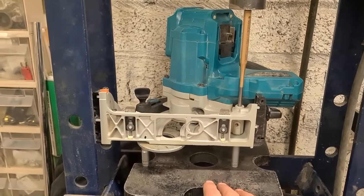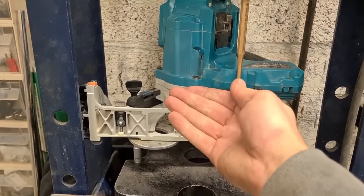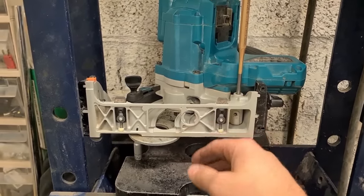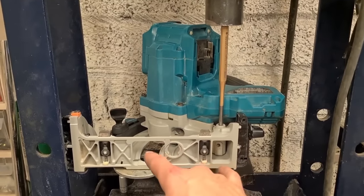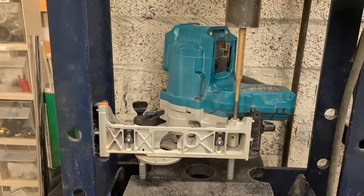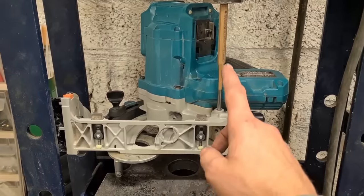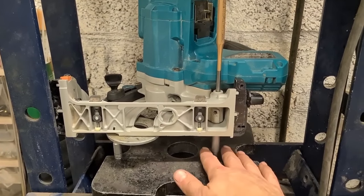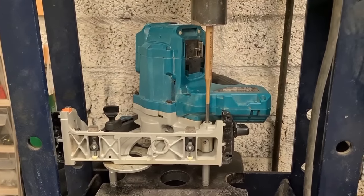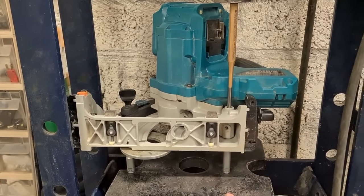If you don't have it sitting as flat as possible before she's put under load, and if you press down, everything's going to lift till it is flat. All your supports will fall, and then if she skates on you, she's going to go flying to the ground. Not what you want. Try to get her leveled and sitting up the way you want before you start pressing down. And once you start pressing, if you're unsure at all, if you think she's going to skate, if you think anything shifted or this isn't sitting underneath the pin, stop and check again. Because if you mess this up and you bust this aluminium housing, you're onto a lot of extra money.